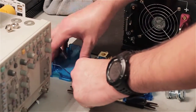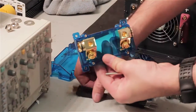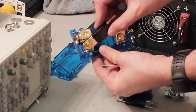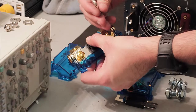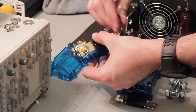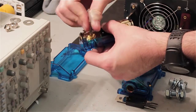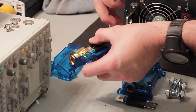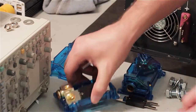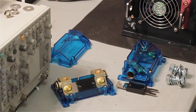Here we are installing the fuse into the fuse holder. Be sure to install the correct amperage fuse based on the fuse requirements determined by the inverter's maximum draw. Fuse amp ratings need to be about 20% more than the maximum current that the fuse normally handles. For example, if the inverter can draw up to 100 amps from the battery, the fuse should be rated around 120 amps.